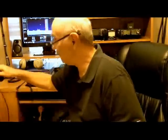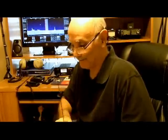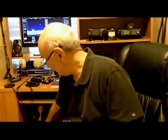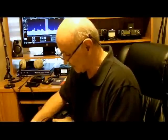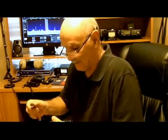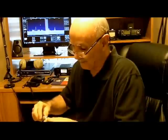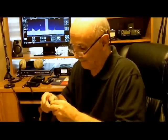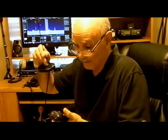Now I can go out and get a little dual band — two meter, 70 centimeter — magnetic mount antenna, available everywhere including on Amazon. I can put that on the roof of the car, on top of the refrigerator, or on some kind of metal plate. It needs to have a ground plane that it can adhere to in order to work properly. This allows me to plug the normal PL-259 connector into the handy talkie and transmit using this bigger antenna to get a better signal.